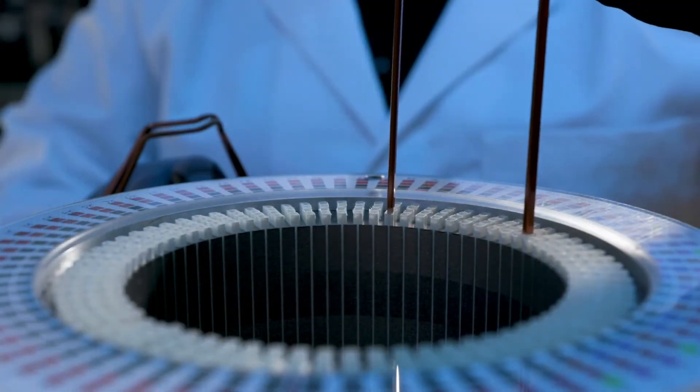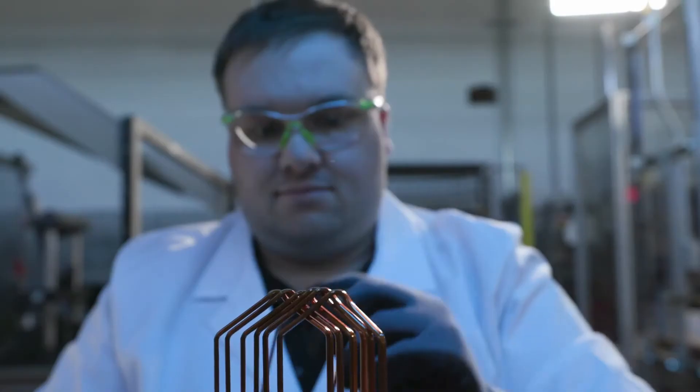If you had two AA batteries or two D-cell batteries in your hand, you'd place them next to each other with the positive sides pointing up and negative pointing down — that's your parallel configuration. Stack them like they're stacked into the sleeve of a flashlight and that's putting them into series. That's exactly what's happening inside the pack: switching from parallel mode to series mode.